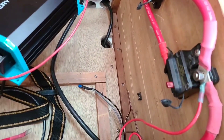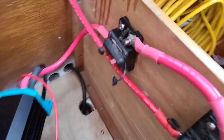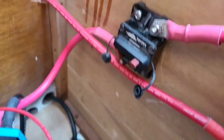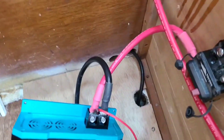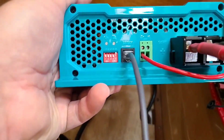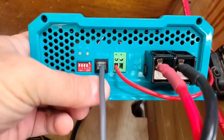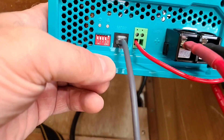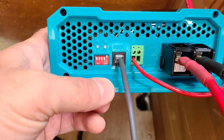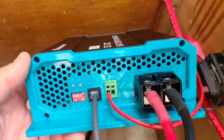Everything is connected now. The charger will be connected in parallel with the windlass battery through the breaker. I have to change it to 20 amp but now it's 150 — I don't know why I put it on, but it is what it is for now and it will work. I need to connect the plus to the D1 terminal — they call it D1, it's for ignition. The red and black wires go to the battery and this RJ45 connector goes to the thermal temperature sensor. The DIP switch must be in the off position, which is the up position for lithium battery, giving a maximum voltage output of about 14.6 volts.